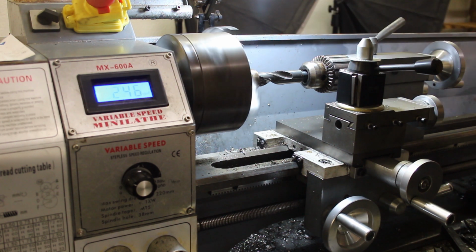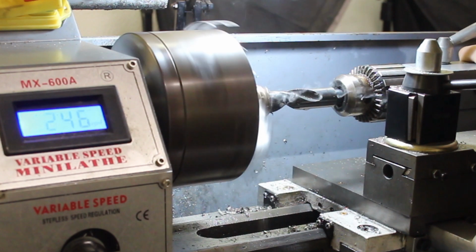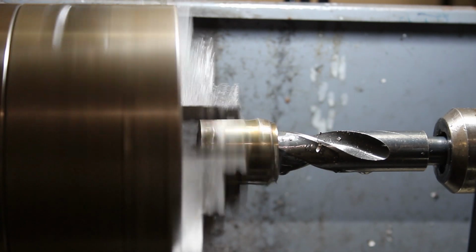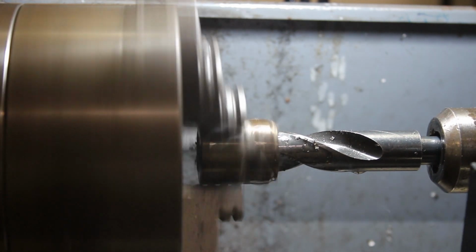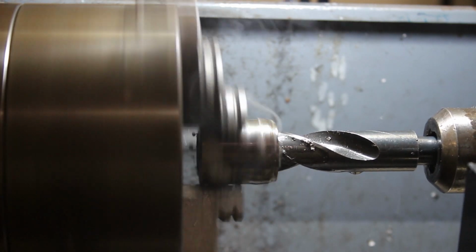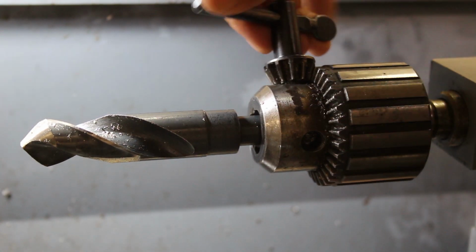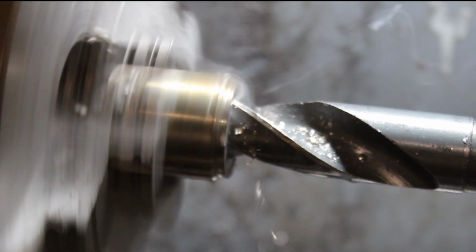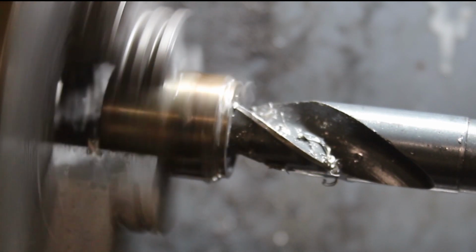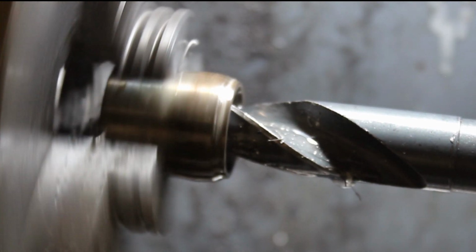So with all the silver gubbins fabricated, it was time to machine a piece of Damascus steel to form the spinner portion of the ring. The first stage of this was to create a hole in the piece of Damascus round bar. So I had the round bar held in the chuck of my metal lathe and then used progressively larger HSS drill bits to gradually drill a hole out of that piece of steel.